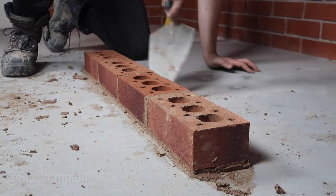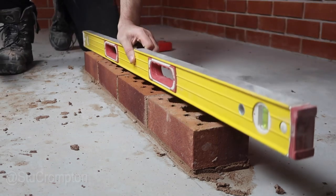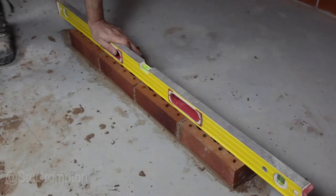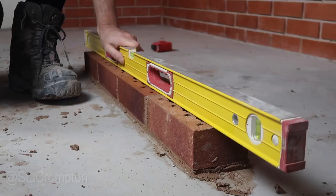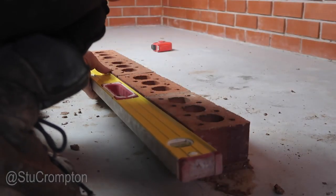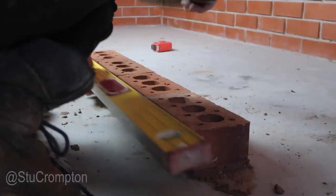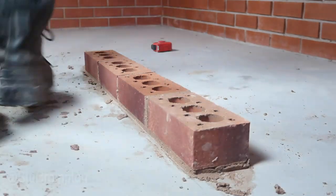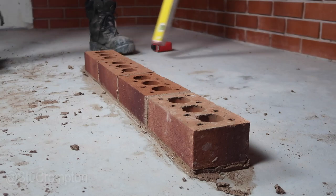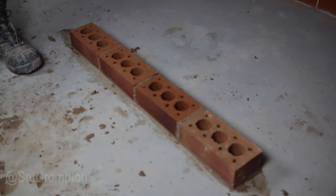Clean your backs as well. You can just go over it if you want — because we've altered them a little bit, a couple of taps, that's nice and level. Then we're going to range it in again towards the top of your bricks so you can see your lines and your arises clearly. And there we have it — that's looking great. And there you go: that is our first full course of bricks ever laid. Sweet.